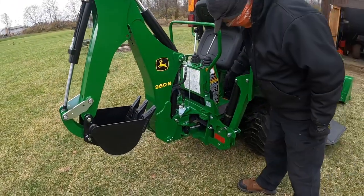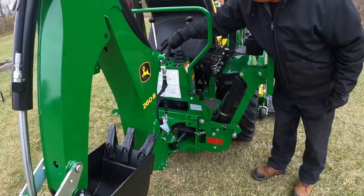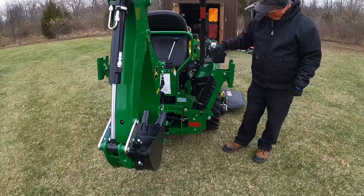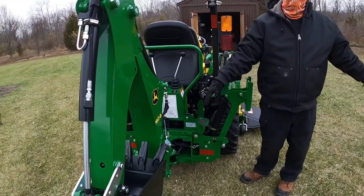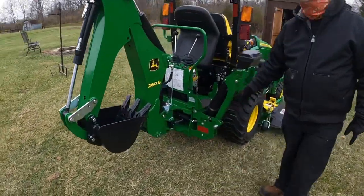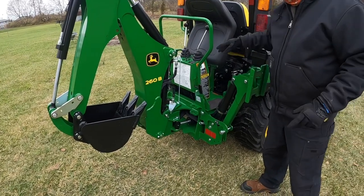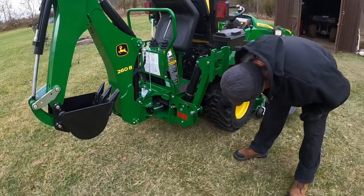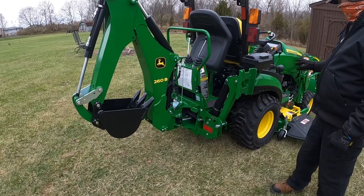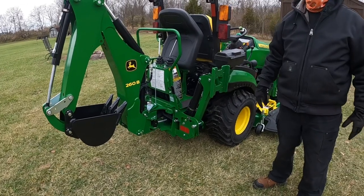And then you got to unhook these. See where that's hooked? If you're going to operate these, you've got your two controls to let those down and bring it down. So if you're going to take it off, you put both these stands down. You go to a tripod, and then you put this on the ground. Then all you got to do is raise it up a little bit so you can pull those two pins out. Remember, he showed you? Pull them two pins out, and then you raise it on up. It'll come up out of that saddle down there. At that point, you can shut it off and roll it forward a little bit and disconnect them two lines, and then make sure you plug them two lines back together so you don't get any leak.